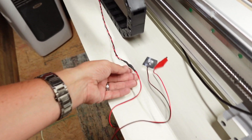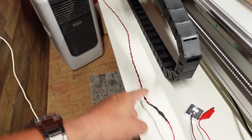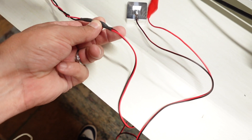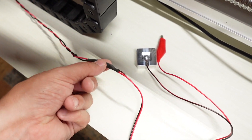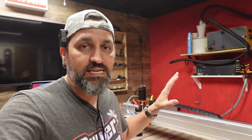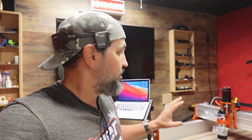The other customization I needed was extending the Z-probe, which wasn't long enough to reach the controller. I cut the wire, connected braided wire by spinning it with my drill, ran it all the way around and back, and used heat shrink tubing to connect and cover both ends. Those were the only two things I needed before getting this machine up and running. For now, we'll use the stock 400-watt spindle.